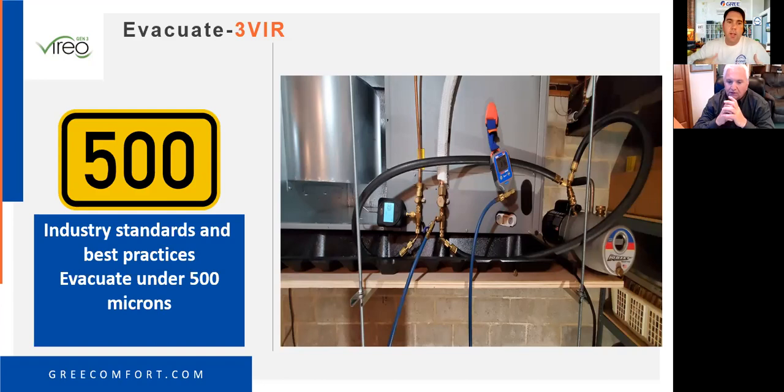Now, industry standards, best practice, in the install manuals, you'll find something such as 500 microns. So you want to evacuate it down to 500. My recommendation as a tech would be to pull it under 300. Scientifically speaking, under 300, moisture cannot exist. So if I get it under 300 and I get it to hold for 30 minutes and it doesn't rise above that 500, I know that I'm good to go.